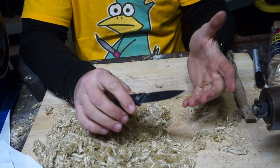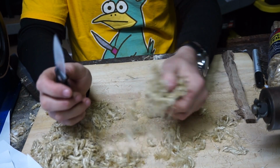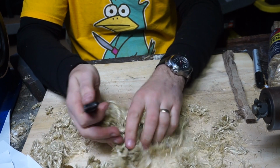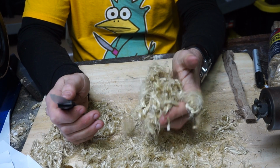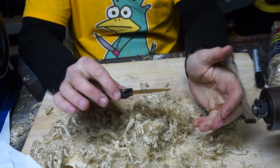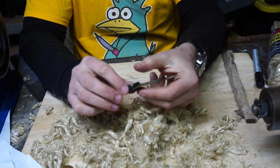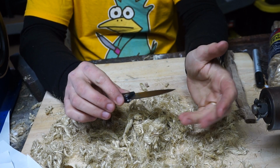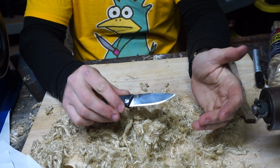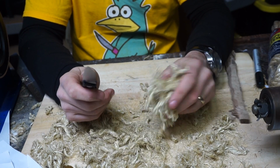As I've said from the start, these aren't super steel numbers, of course. What I'm trying to show you is this is a lot of real world EDC use. All this rope, a fair bit of cardboard, a lot of food, a lot of clothing tags. Just think about steepening your edge just a little bit. This is getting towards the crazy side, but even if you steepened it to maybe 15 degrees per side or something, the steel can take it and it's going to boost your performance. That's just what I'm seeing, it's what I'm finding.